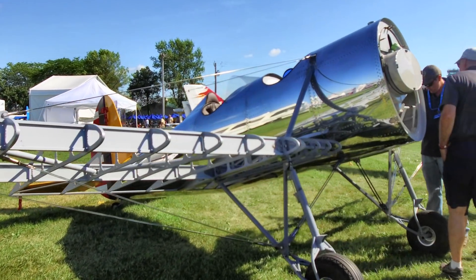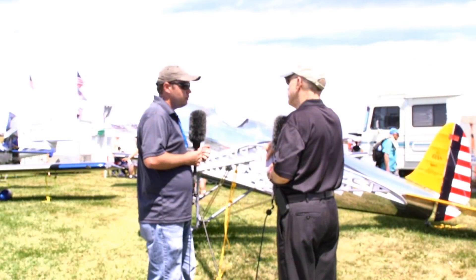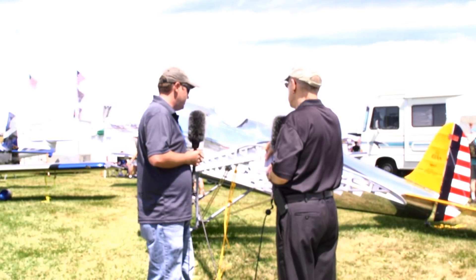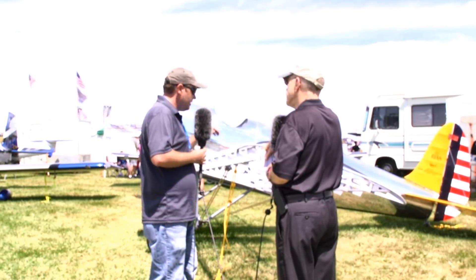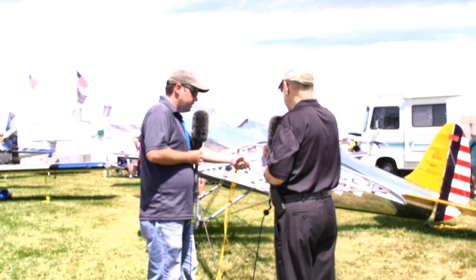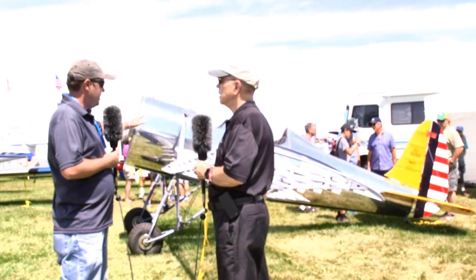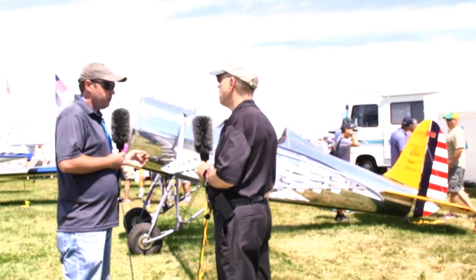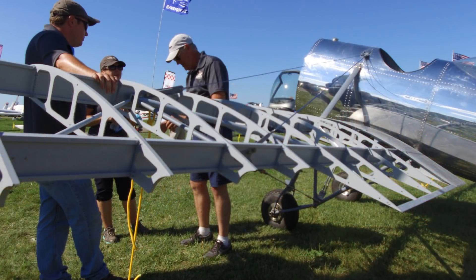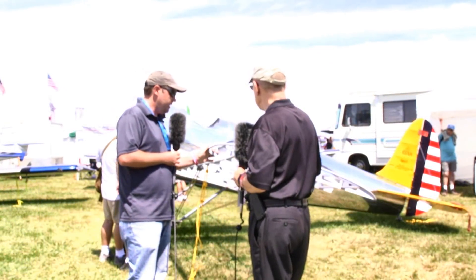This wing you can actually stick on a table and have jigged up in a day. It's very easy to build. All you do is trace the wing out on the table, pin it down with a couple of 2x4 blocks with screws, and keep measuring things. The way we have it designed, you stick some popsicle sticks in here and that gives you your spacing - pull the popsicle sticks out and your rib is where it goes. This airplane is all hand built, but the kits are CNC cut. There's interesting material in here too - it looks almost corrugated.